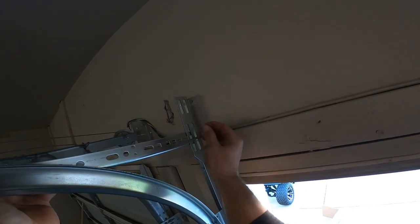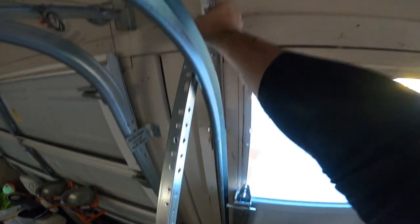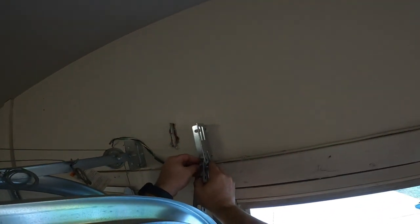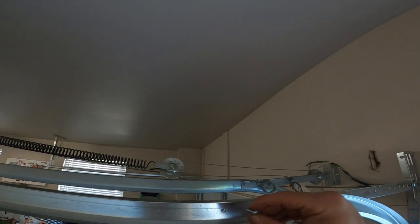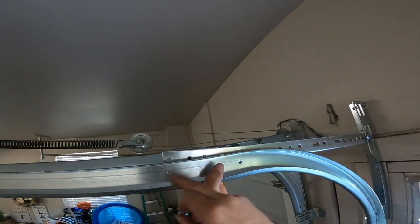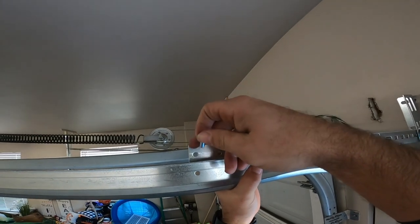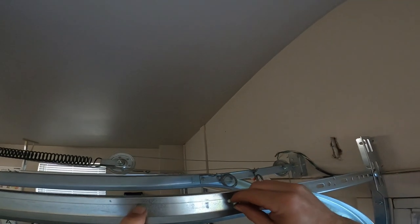Carriage the flathead to the inside. And that's just to make sure you got it. Stick the bolt on there so it holds. Again, make sure it's lined up. The last screw hole closest to the radius bend to the last hole on your stabilizer bracket right here. Go ahead and stick both of those in there.